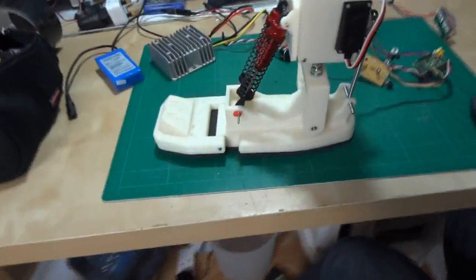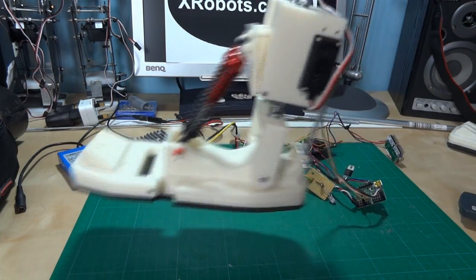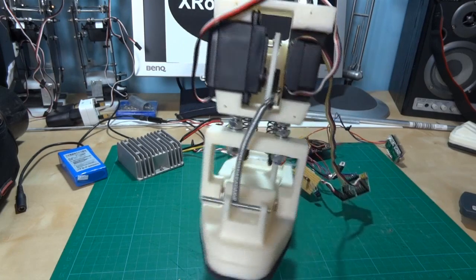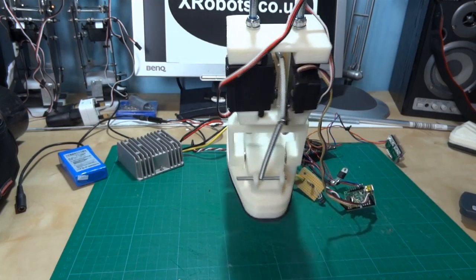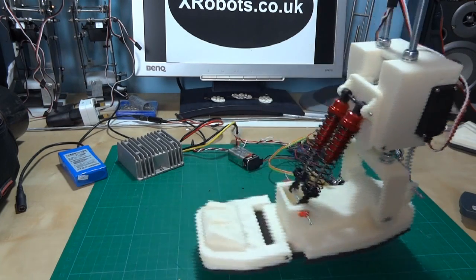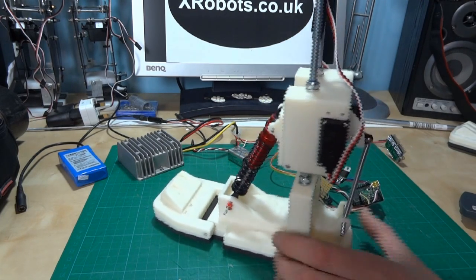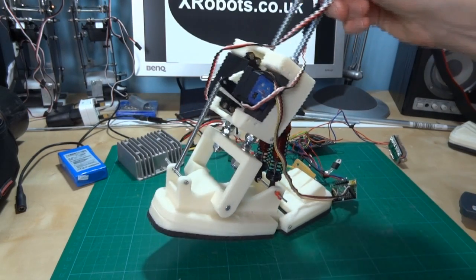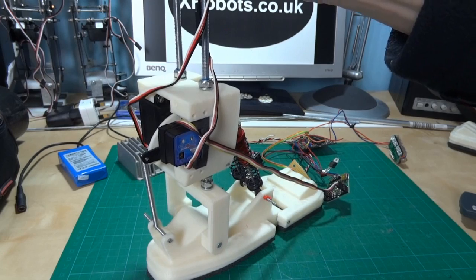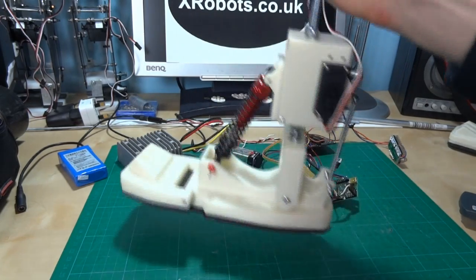At the moment it's set to the least sensitive. If I turn up the sensitivity — basically by hitting the remote, which makes the PicAxe send some more serial data to the servo controller — and then wave this in the air, you should be able to see it automatically kicking forward. And that's basically just based on its motion. So taking a step forward with the leading foot — that's fine — and then when it's the trailing foot, if I compress these springs, you can see the Achilles decompressing so that it can move forward and then automatically tightening again. So it should kick forward, which is what we want, so it rolls onto the ball of its foot.